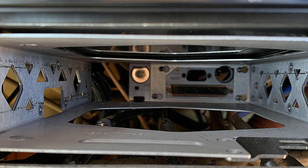After getting everything back together again, I realized using thread sealant was probably a good idea, but I would have used the less permanent type had I any. Reassembly of the bracket onto the tray is the reverse of the removal. I thought I might want to tighten down those four floating screws with the support bracket, but I didn't have a long extension. It's probably a good idea to leave some free play anyway, since there could be a bit of an alignment issue for the pins. The key thing is not to have the main connector able to back away from the bracket holding it, occasioned by loose screws.